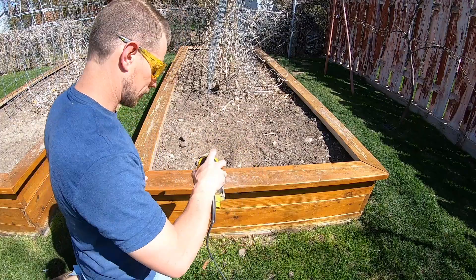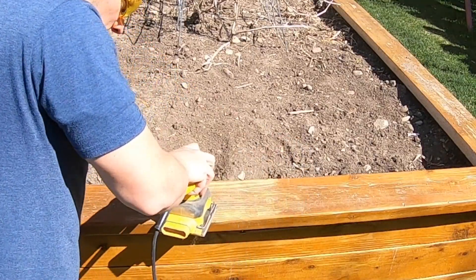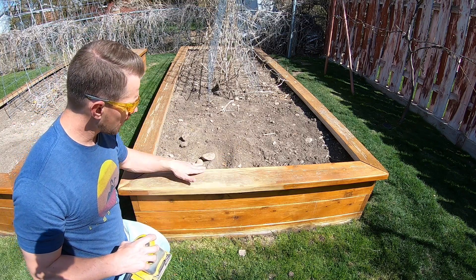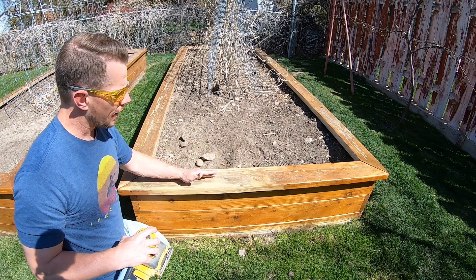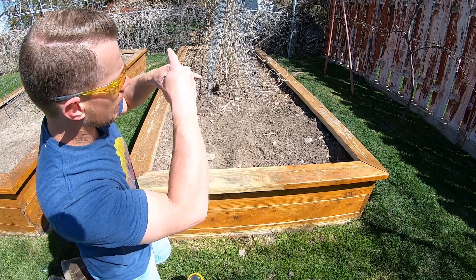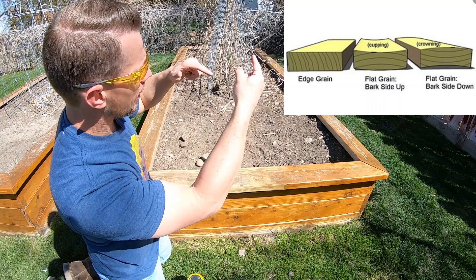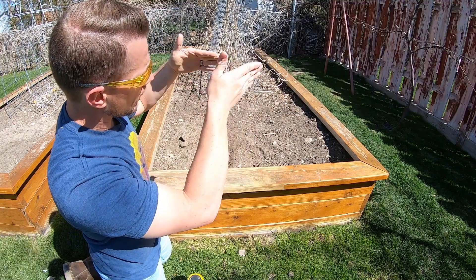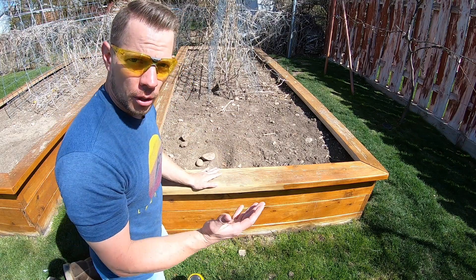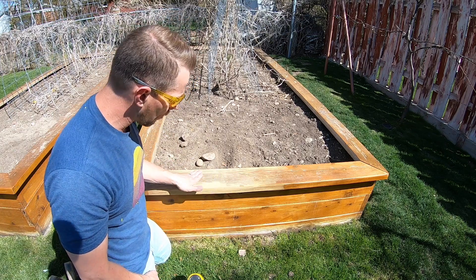Now we are ready to sand. As you can see, this part is sanded really heavily and this part is sanded heavily, but this part isn't — and that's because the wood is actually cup-shaped. If you were to look at this piece of wood on end, you would see the grains going like this. If I would have been smart when I built the box, I would have put those curved grains facing downwards so they cup downwards, because wood will always do that, especially when it's exposed to the elements. Shoulda, coulda, woulda. Now we're just going to keep sanding this down and work into that cupping shape a little bit.